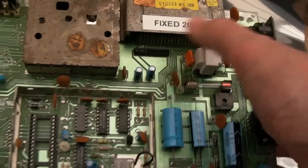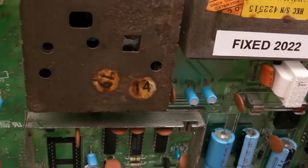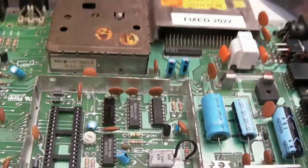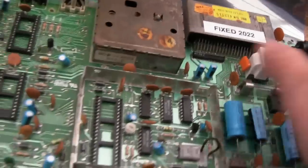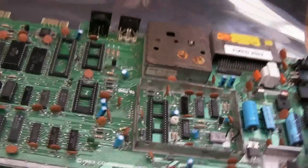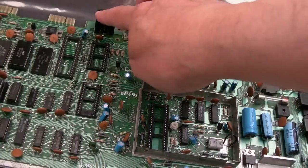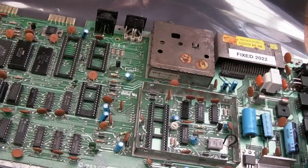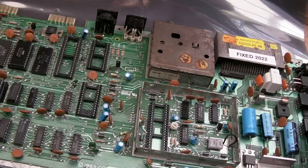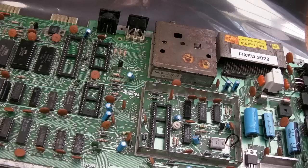You know, I marked it up. Corrosion mostly came off that. You can see it looks a horrible colour, but I wiped over that with some oil. You know, it's clean to touch. A little bit oily perhaps. But yeah, it's not going to rust, and inside the modulator that's fine. The modulator does work, everything works. The serial port and everything works. Tested all that sort of stuff with the SD2IEC and the 1541 Ultimate. So the tape port works and everything.